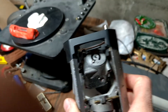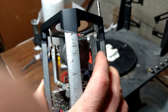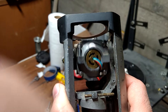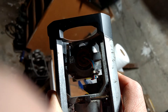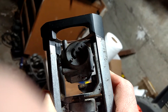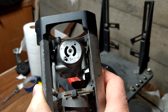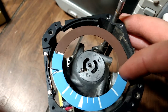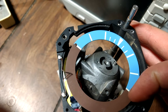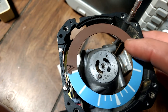I'll try to simulate that. I'm holding my finger on the gimbal here, so it can only turn in one direction. And then I'm rotating around as if the whole Earth was rotating. See how it aligned? Now I'm going to go back the other way, because I'm reversing the direction of the Earth, and the gyro compass spins back around and tries to keep aligned with the Earth's rotation. And it's that force that it uses to find the true north. What I mostly wanted to show here is that the inner part takes whichever the shortest path is — it could turn one way or the other way, whatever the shortest path was, because then it converges on alignment.